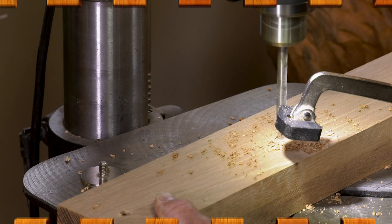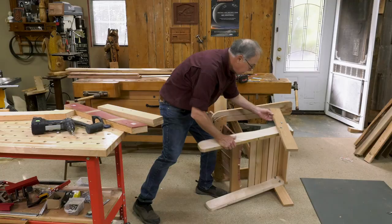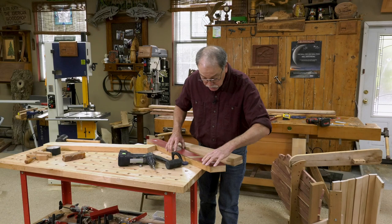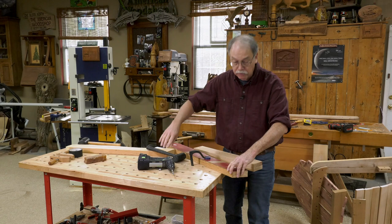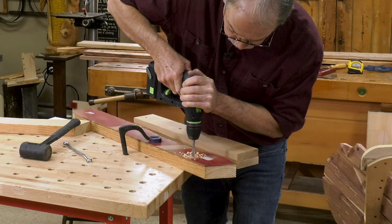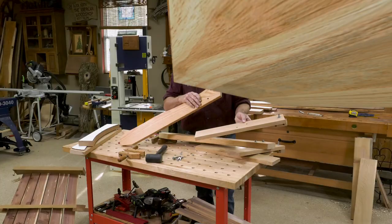I want you to understand exactly the dynamics of that leg. There is how it fits to the total assembly of the chair. As long as this is square right here when it sets, everything's right. On my template, I have holes here, and you can get this template and the plan for this off Facebook. I could drill this on the drill press, and you don't have to have a drill press as long as you're good at keeping the bit square as you drill these holes. I'll drill these holes all the way through — it pays to have good sharp bits. Then we'll bolt the parts together.